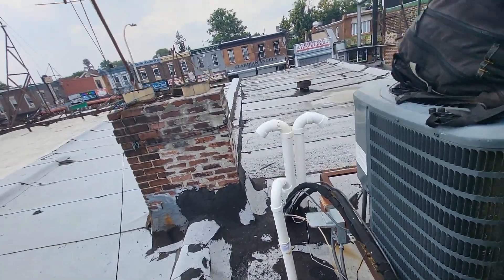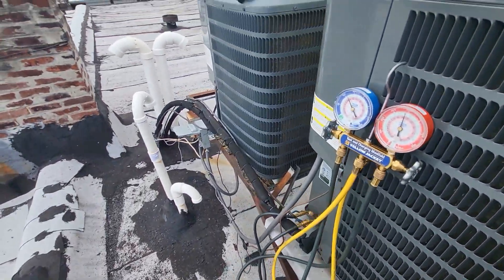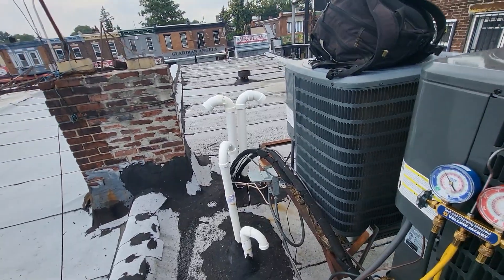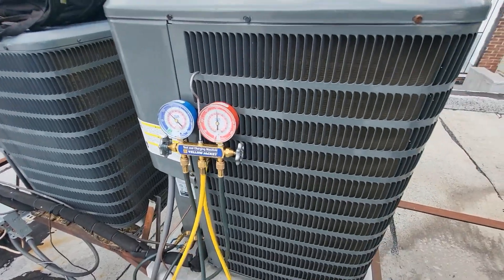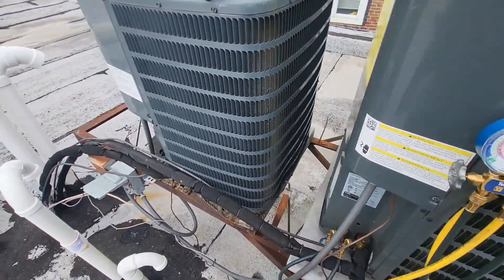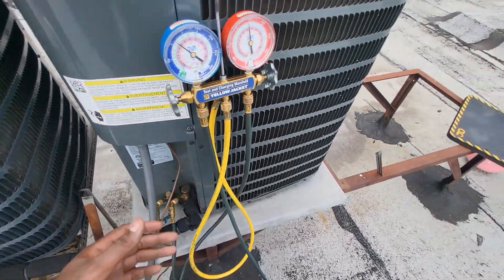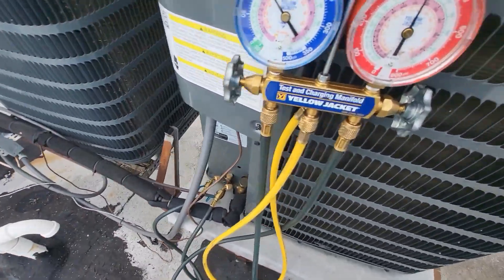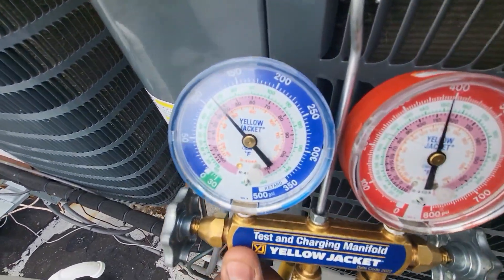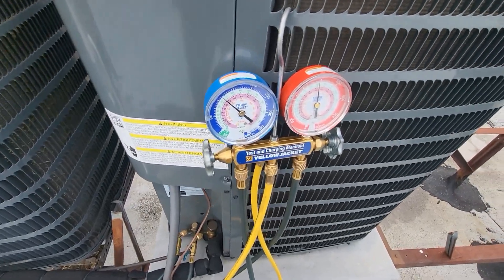What we have here is another video — this is a daycare. This property has two systems, two furnaces in the basement. Last fall we did a heat maintenance there but it wasn't anything major. They got two 90-percenters downstairs, but the reason I'm making this video is a no-AC complaint. The customer said the AC unit froze up. One is working fine but the other one is definitely having issues causing the unit to freeze up. Everything downstairs checked out fine — airflow is fine, filter is good. I just hooked my gauges up and by the way this is a Goodman 13 SEER unit, I want to say this thing is under 10 years old.